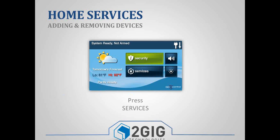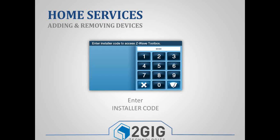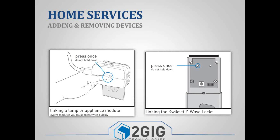So to add a device into your network or remove a device, you'll press Services, and then in the bottom right corner you have Toolbox. It's going to ask you for your installer code. And then with your Z-Wave Toolbox, it's pretty simple. It's just add or remove. So go ahead and press Add. Now, when you press the Add button, the panel goes into a pairing mode, just like your phone would when you're trying to pair it with a Bluetooth device. So the panel is going to start looking for devices.